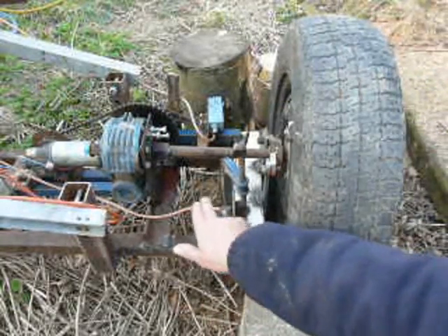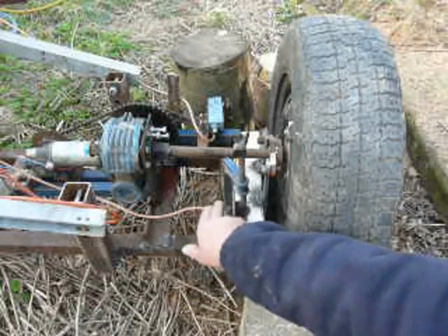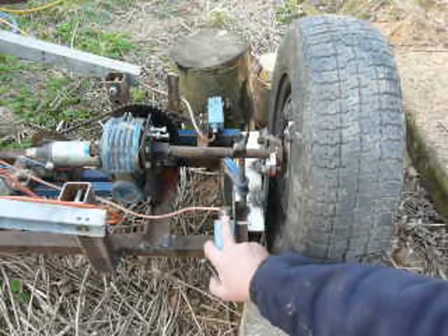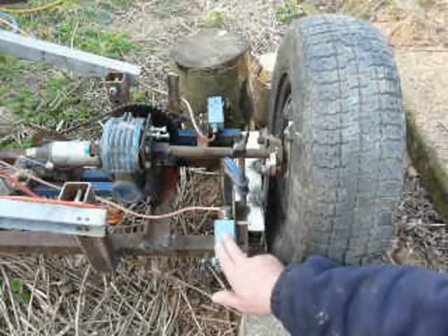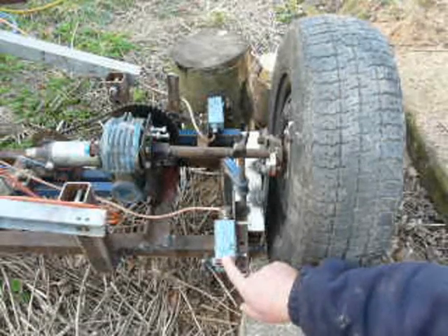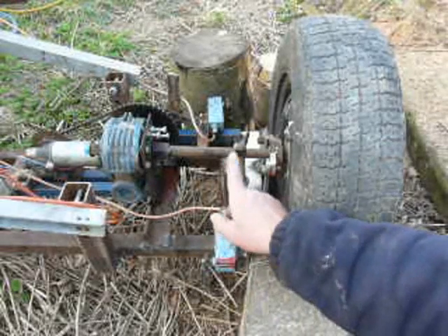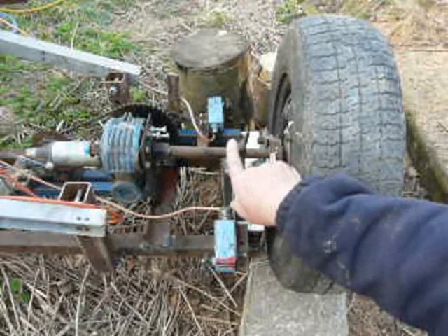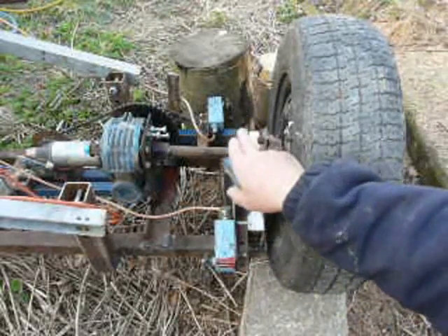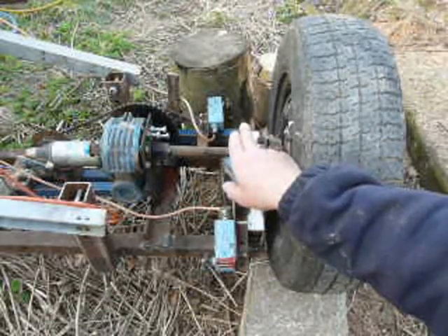However, if we have a diode in here that only lets positive through on one of the wires, when the polarity's turned round, that diode effectively switches this off. So this can switch back on and it makes no difference, because the diode stops the power going through to the limit switch. This is just an industrial micro switch — very good they are. So the other one has got a diode in it as well, so that behaves in the other way — that's set to let the positive through when the polarity's the other way round. So it'll run along, and as you can see, it's up against that block of timber at the moment, and we'll have a better end stop at some point. This is all work in progress.